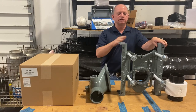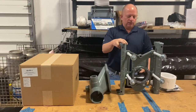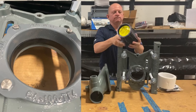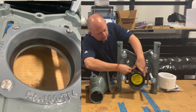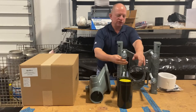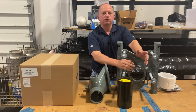The big difference between what you're used to dealing with and what Watts does is they use a compression nipple. As you can see, this is smooth — there's no threads on it — and there is a rubber seal in here that's about three-quarters of an inch thick. So instead of screwing the nipple in, you're simply pushing it in, and once it's set where it needs to be you're just tightening these bolts slightly past hand tight, because it's such a huge sealing surface it'll lock the nipple right in. The only issue is everybody thinks tighter is better, so they over-tighten and might bust an ear off the compression ring — that's really the only problem we've ever had.